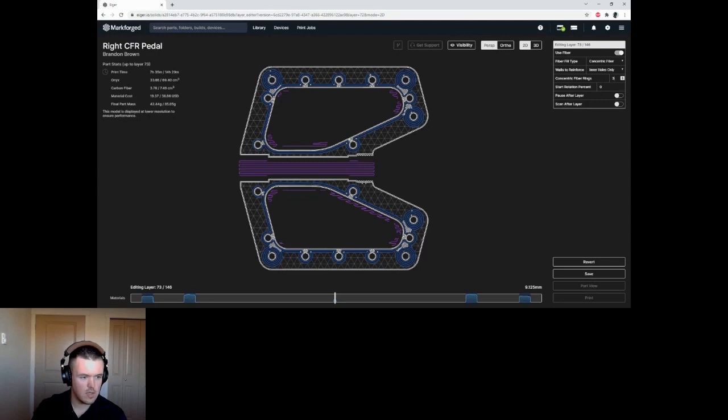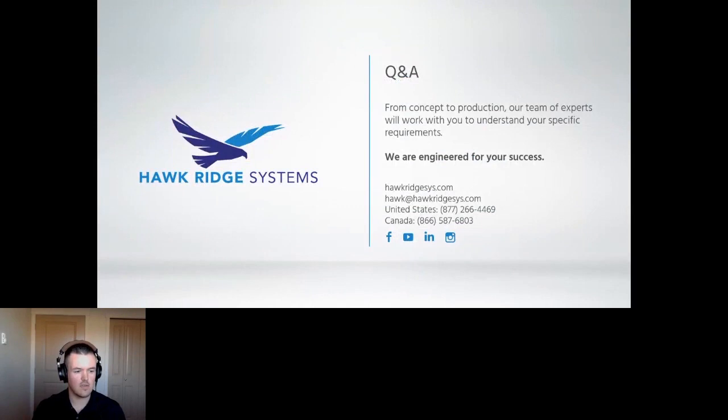Well, awesome. It looks like we are getting close to the end here. How large of a chamfer can be added near the print bed using the 45-degree rule? This is in the design guide, but it kind of depends. The size of the chamfer, theoretically, can be any size you want. But in terms of reducing splay, that warping or swelling you would see on the first layer, 0.5 millimeter to 1 millimeter by 45 degrees would be a good starting place. I typically go with about 0.5 millimeter.